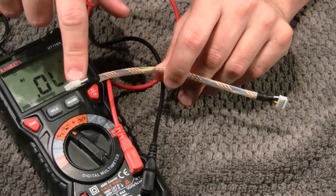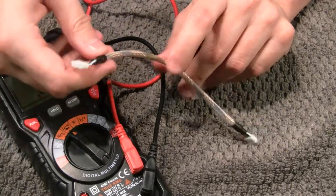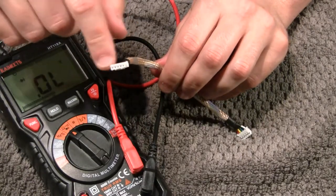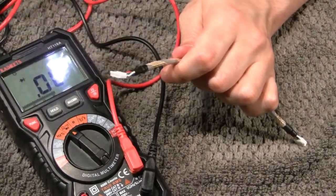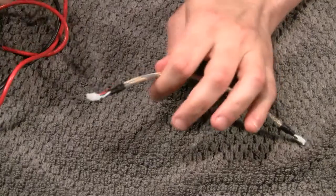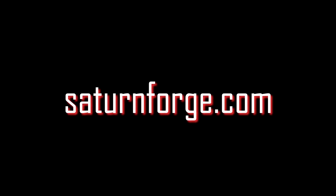If not, I did leave a little extra wire, so if I did screw up I could probably extract the pin and redo it. One other note: when you're doing the other side, you want to make sure the wires are cut evenly. These were cut pretty evenly, so it's pretty good. But if you miss that, you're going to have trouble when you try to put in the pins — they're going to stick out every which way and it's just going to be a horror show. That's all you need to do to work with JSTs. Let's talk about DuPonts next.